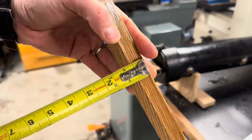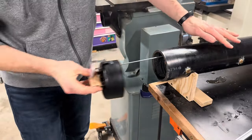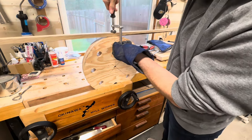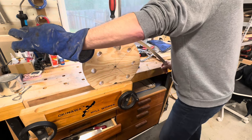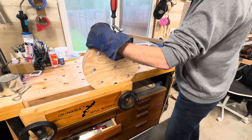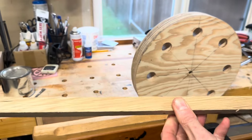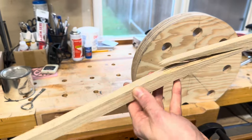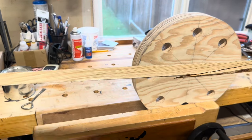So far in this video I had only been bending smaller thin pieces of wood — half inch or less — and I thought it would be fun to see what would happen with something much thicker. Here's a piece of 3 quarter inch white oak. It's important not just to avoid knots but to have nice straight grained wood, and here is an example of why — that grain was not straight enough to bend without splitting, and having some sort of backing probably would have helped. Oh well, it was worth a try.